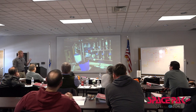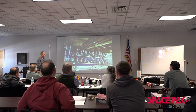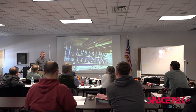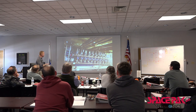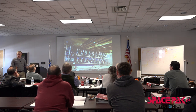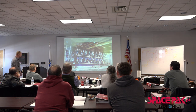When I show you the next picture, well, this one works great, and you can't really see it because he took it off the very end of the manifold. So that one's basically getting full flow all the time. All these other ones, even if they, how many GPM is a Grundfos Alpha pump going to do? Maybe 13 on its best day downhill with the wind at its back, right? It's not going to do much more than that. And every one of those needs it. So we've got to make sure that things are sized properly.